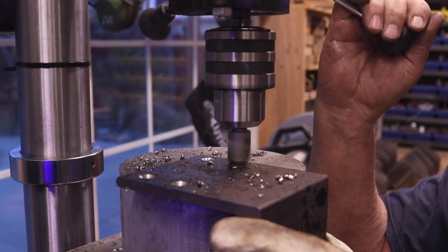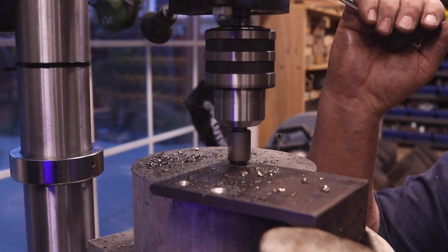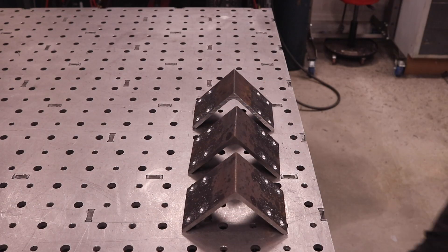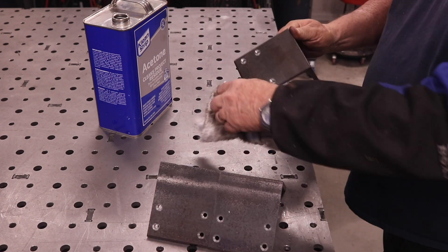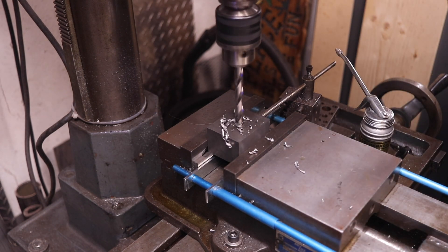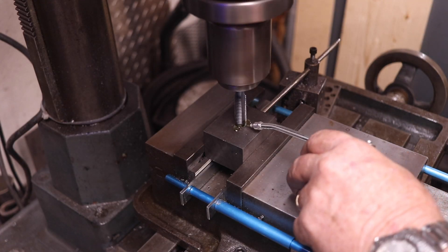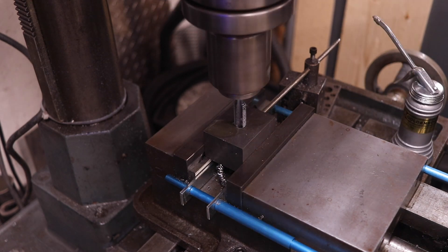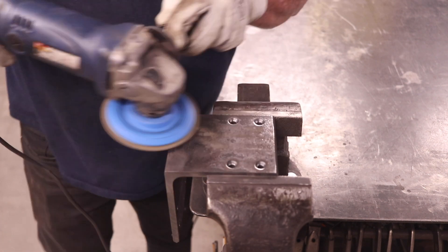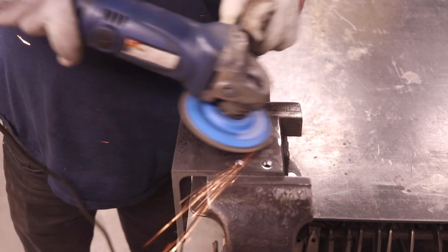Once the drilling was done, I countersunk using the same drill press setup. I bought a couple of carbide countersink bits at KBC Tool and they went through there pretty good. For the tapped holes in the blocks, I jumped over to the mill with a stop on my Kurt vise, slid the pieces in, drilled them perfectly, then speed-tapped them right through with a gun tap. The pieces had a little rust so I used a flap disc to clean up the areas we'd be welding.